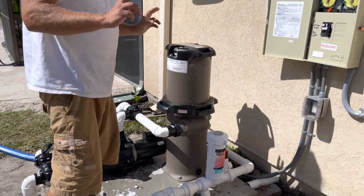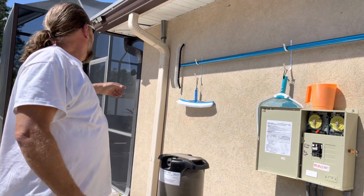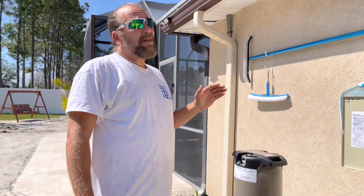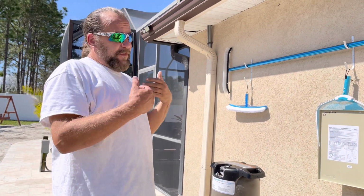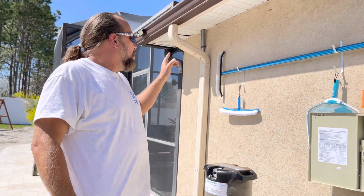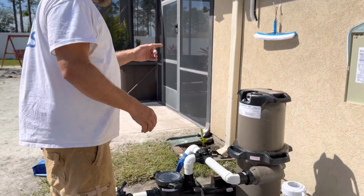So they're both what they call chlorine reducing devices. So you've got a really almost a green pool. You're going to be running probably 1 to 0.5 parts per million. You're probably going to be running the lowest amounts of chlorine allowable and still have a crystal clear blue pool, which means for me, no chlorine. You can have tap water basically with your system. Cool? Yeah. All right, now I want to clean my filter.